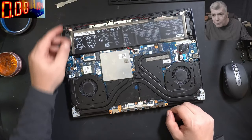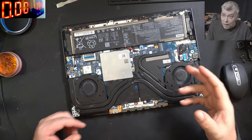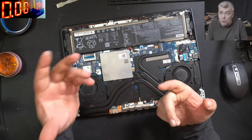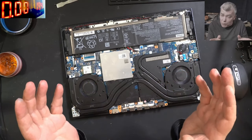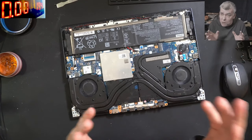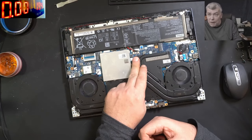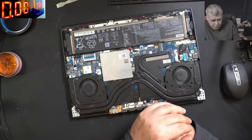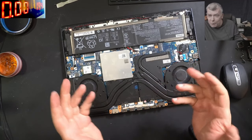So what is the problem? Everything seems fine - we replaced with a good EC chip, we programmed the EC chip with brand new firmware from the Lenovo website. The BIOS doesn't have serials because I programmed a brand new BIOS, also from the Lenovo website. The original BIOS had a password on it. Everything is brand new but the laptop is not working.